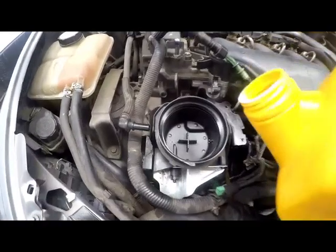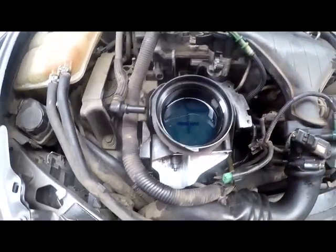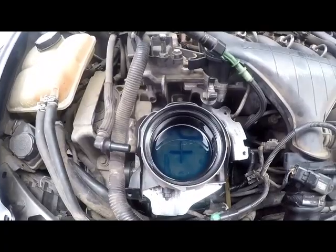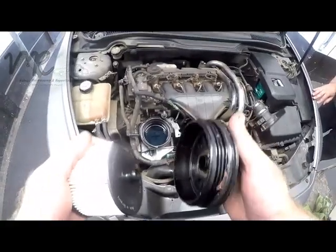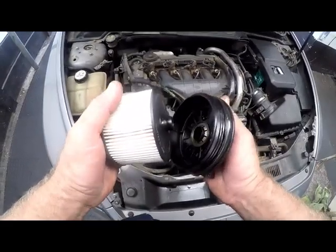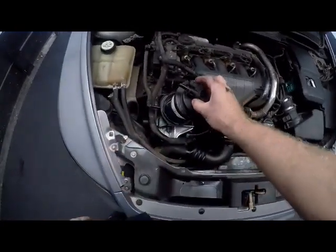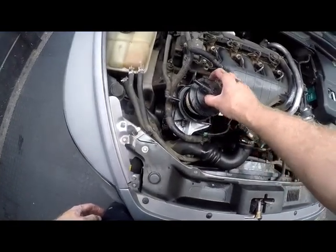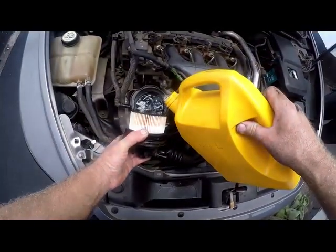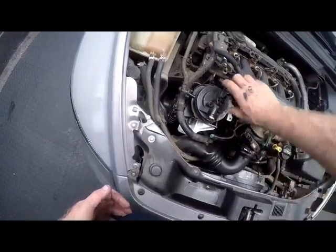Make sure you've got some nice clean, freshly bought diesel, because diesel deteriorates pretty quickly. Fill it about half way — if you put in too much and then put the new filter in, it's going to expunge a lot of the diesel. Once again, we have the new seal on with rubber grease on there so it turns nicely and doesn't seize or stick. Put the filter in nicely — now you know the filter is in the proper position. You can put a little bit more diesel in, but don't put in too much or you'll make a big mess. You'll see the filter soaks nicely. Now we can tighten it up.